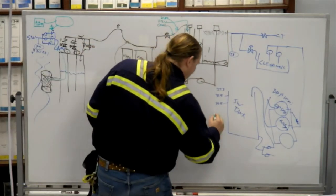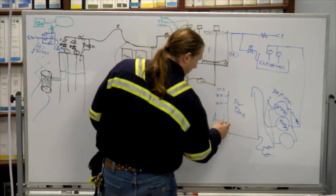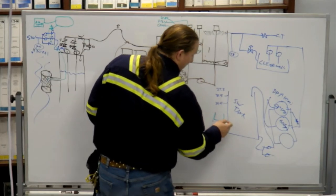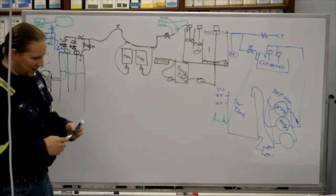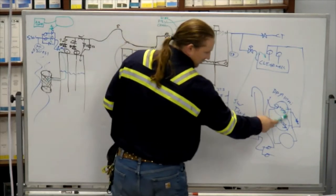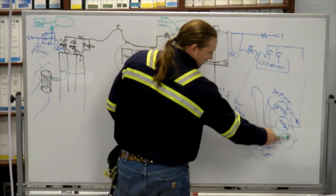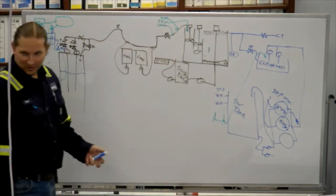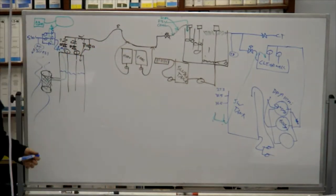There is a tote that takes water off the surface water pumps and transports from that tote to the clear well. And this does not look at the 600 gallons a minute. This is just on or off. So if you go tweaking these so you're not getting 600 gallons a minute, then you're throwing off how much of the chemical they're using. Not the end of the world, but it's not as great as it should be.